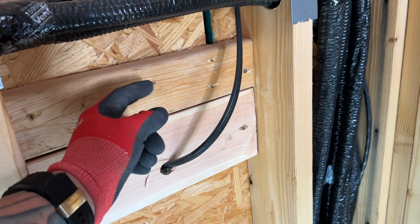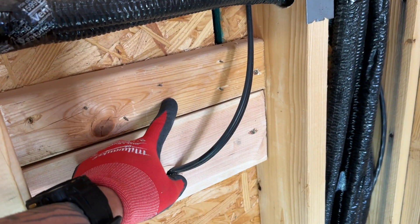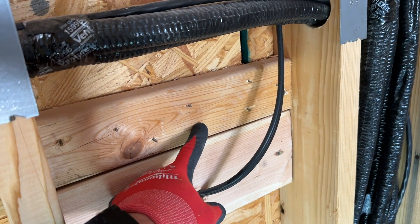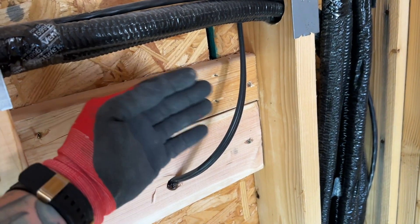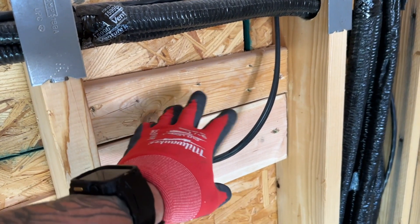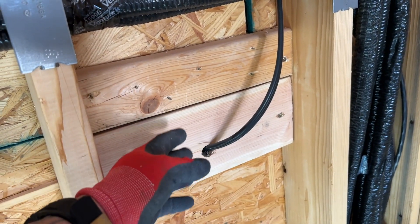Because I had this open, I went ahead and did this so I knew when I screwed into it I'd have something really solid. But if you're going to do it into the stucco or the concrete, just use a good masonry fastener or the adhesives they have. They also have little shoes that go inside that will help secure it. Either way, just make sure that while you're securing it to whatever exterior surface, you're getting a good bite with whatever fastener you need.